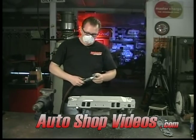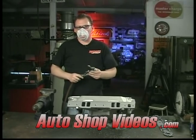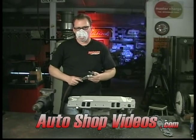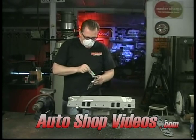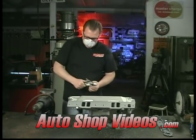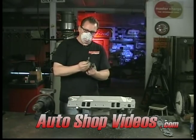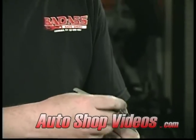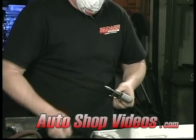I'm pretty well done — hogged that out now. This is a pretty big fluted bit made for taking lots of material out. Now I'm going to do a little more finish work and take a little less material out, so we're going to change bits. We're going to go to one that's a little less aggressive. You can see the flutes are a lot smaller — it's a different shaped bit, a little less aggressive. Pop that in and give it a little cinch up.